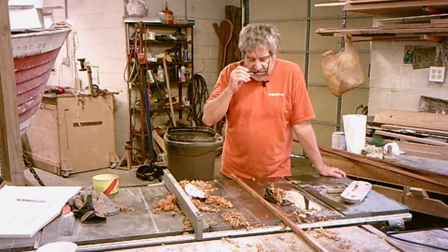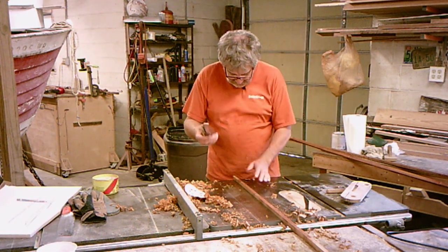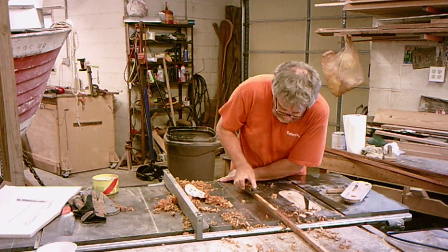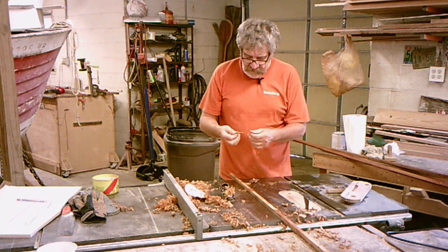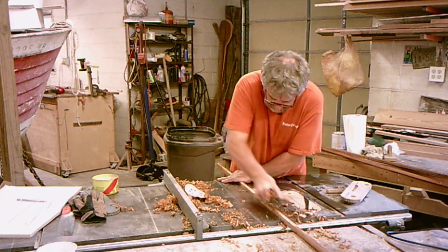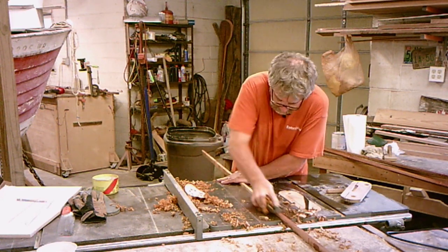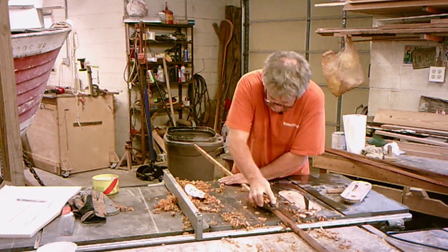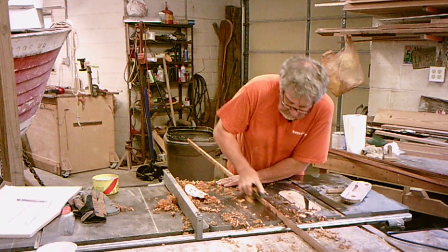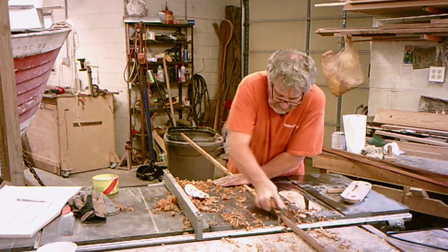Some of these aren't as smooth a finish as I'd do for somebody, so I'm just taking my block plane and lightly passing over them, cleaning them up. I didn't take a lot of time sanding these, and since they've been old they're hard to sand. The shavings I'm taking off are just paper thin — I'm basically just scraping the top layer off. A couple had a little bit of paint on them, and the plane just scrapes that surface right off. It gives a better quality wood in the boat than anything I'd get from the rack or buy new. Keep that in mind when you're shopping for stringer stock.